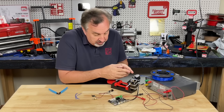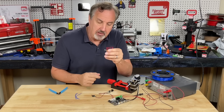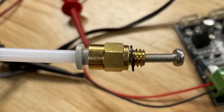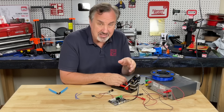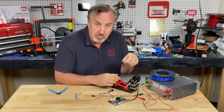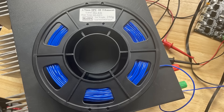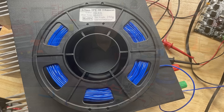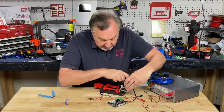I want to measure how much I'm going to compress the TPU using the motor. I took another coupling, put a screw in the end to block it, and placed it on the end of the PTFE tubing. Now I'm going to push TPU into this until it stops — not forcing it, just manually pushing until it stops. I'm using this off-brand TPU; I've got several spools and they're some of the worst for stringing. If I can get this to work, I can get anything to work.